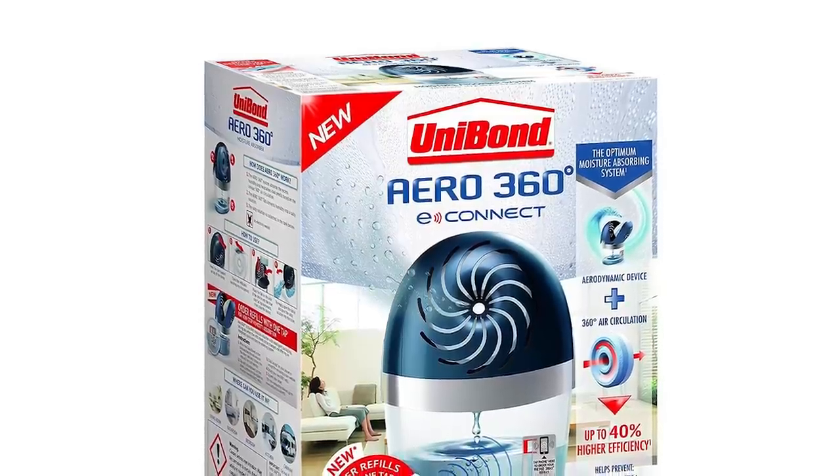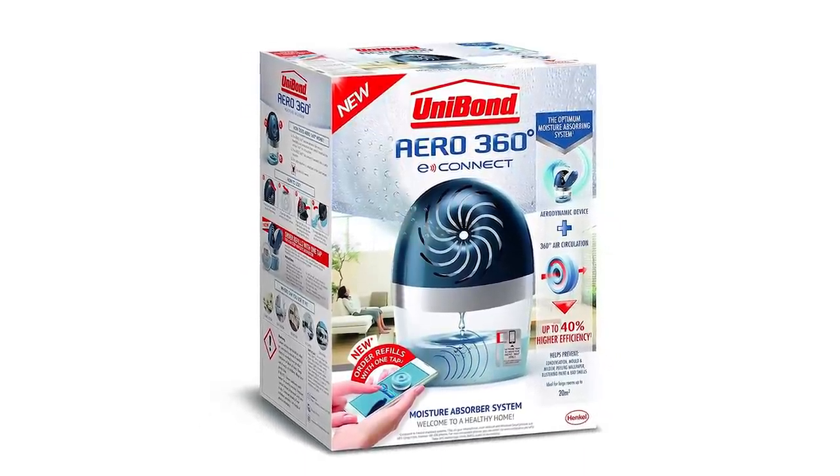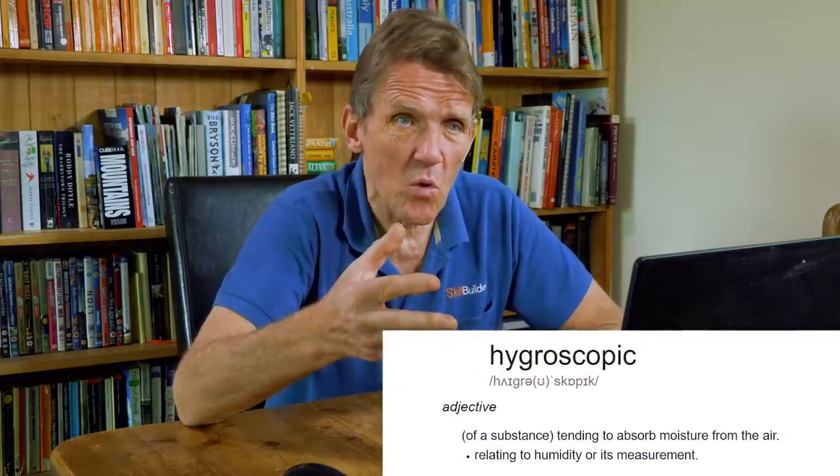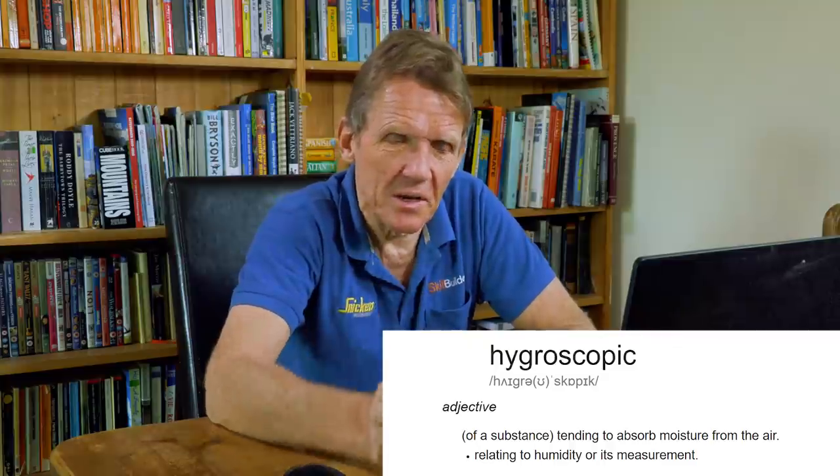It's got two chances: either it's coming down from around the window, or it's condensation. If it's condensation, get a couple of Unibond moisture traps, put them on the windowsill, and see how much moisture they gather over 24 hours — that gives you a clue about humidity levels. He probably needs more ventilation. Rather than jump to conclusions, prove it first. And don't use bleach — bleach is hygroscopic and will attract new moisture. Use a proprietary fungicidal wash instead.